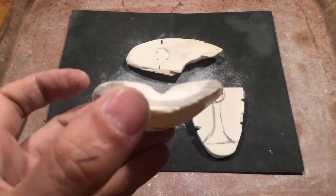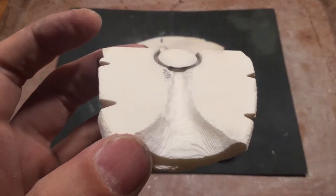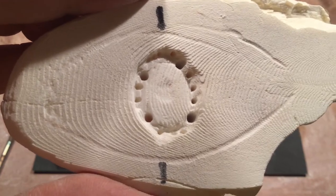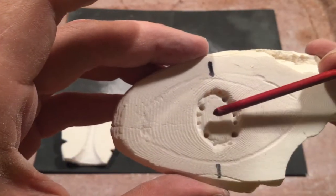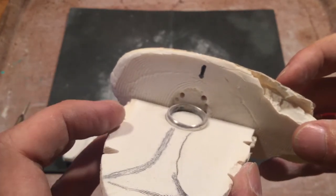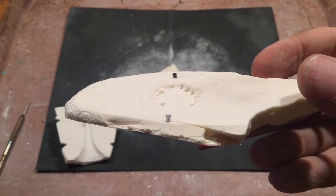You can see now we've carved out the sprue gate and an area for our button. Metal can flow down that entire trough all the way to our ring and then fill into Part C, which is our stone setting. In the very center there's a residual impression of where the band ring locks up in the design, so you can tell the metal is going all the way into that flow point. We can make this thicker if we want, but it's probably three to four millimeters thick, which is pretty thick for a casting.